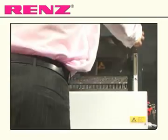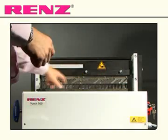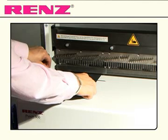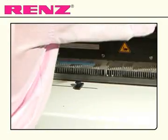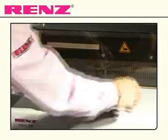To begin punching, remove the safety screen to allow you access to the punch pins. Set the adjustment screw to the correct paper size. Place your document against the side lay and remove the pin at the far edge of the document. Replace the safety screen and begin punching amounts up to four millimeters at a time at unrivalled speeds.